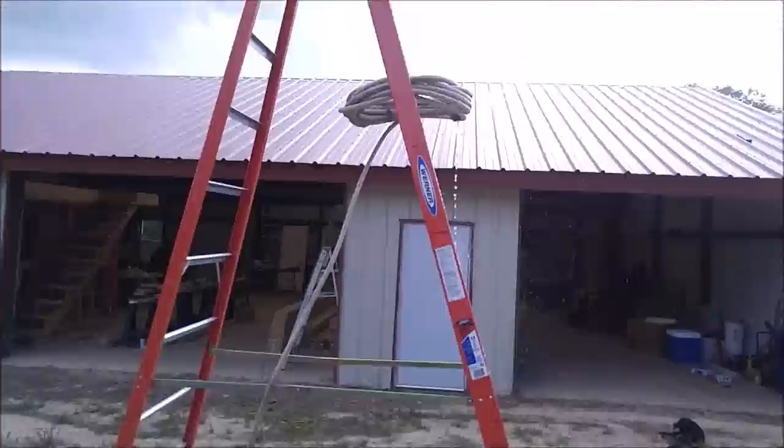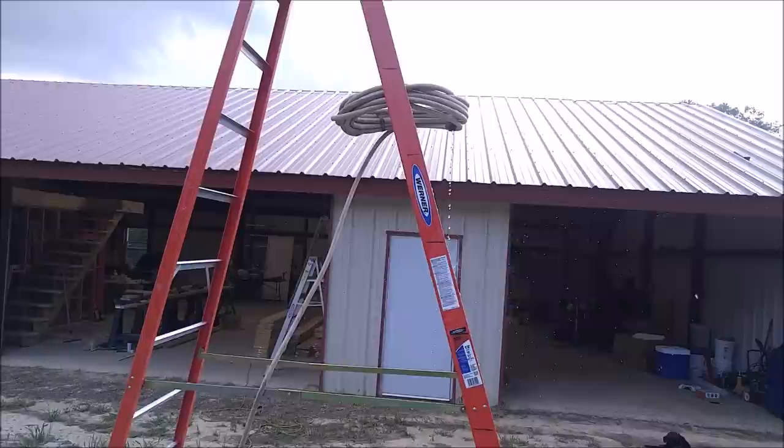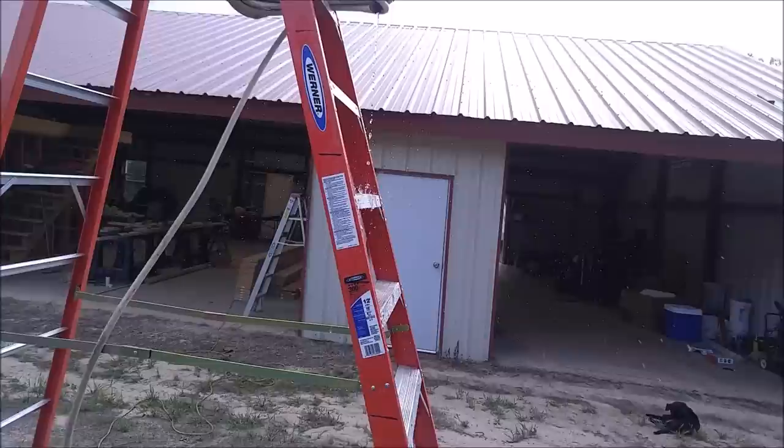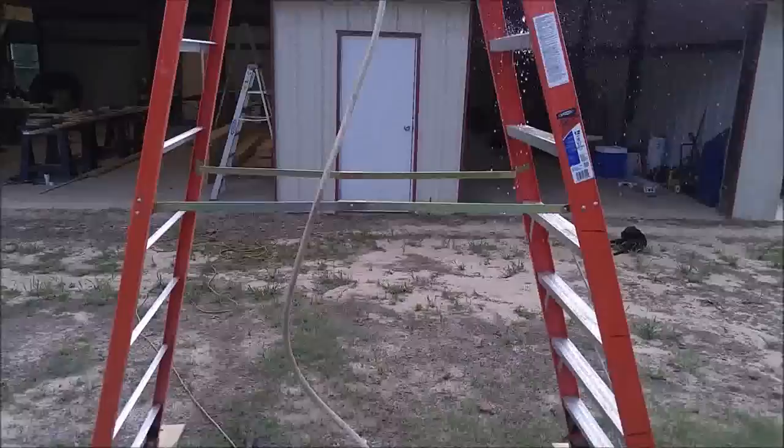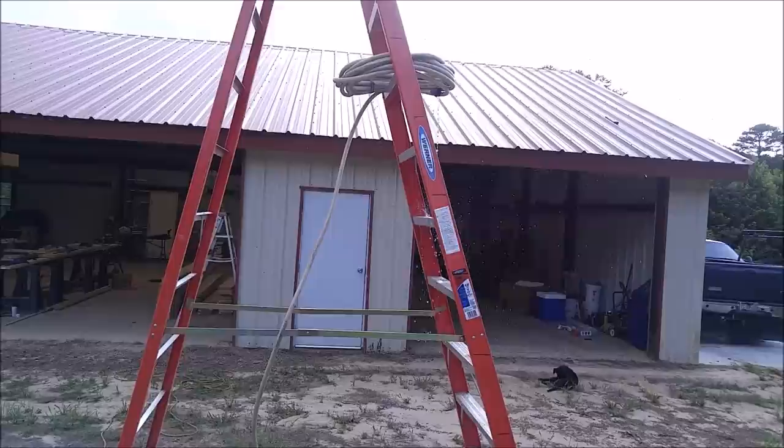In terms of being able to prime through a three-quarter inch garden hose, it maxes out at eight feet. I might get a little bit more if I didn't have all that extra hose at the end, but just over eight feet is about all we can get for it to self-prime. Not too bad — not as good as the other Kedsum pump I've reviewed, but it is better than the other pump I reviewed last year. So it's respectable — for the rating, I think it's right on par.